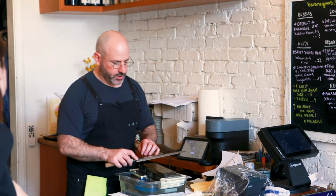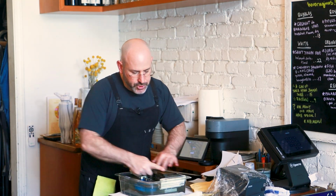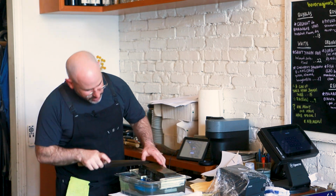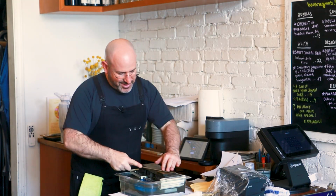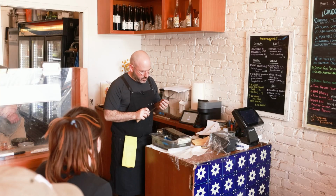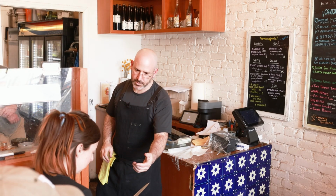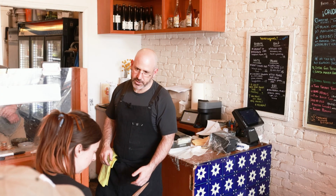I'm just going to run through it because I want to show you the micro bevel at the end of this as well. Can I feel the burr again? Yeah, it's really, really small on this because I'm trying to blast through it, but I will do one for you in a little bit so we can be 100% sure. Same deal. Am I on the right side? Nope, I've got to do it again. One second. Maybe I'll have a burr for you in a second anyway. Really, really small, but go ahead and feel for it. So it's on the back side, yeah? It just catches your fingertips a little bit there.